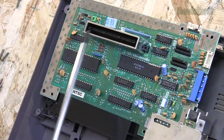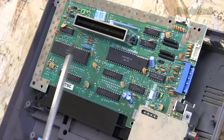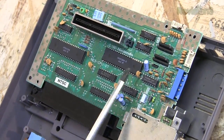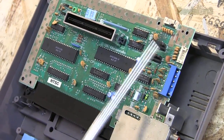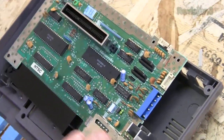Here's the underside of the Nintendo circuit. We have the expansion port, which is never used. CPU, picture processing unit, buffer, RAM, lockout chip, a NOT gate — and I'm not sure what those two do. There's not much to it. Here are the pull-ups for the controller. Controllers use shift registers, so they're actually pretty easy.